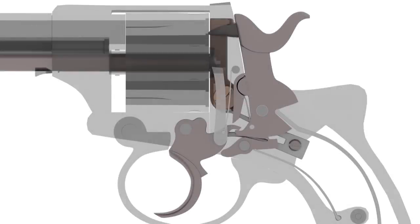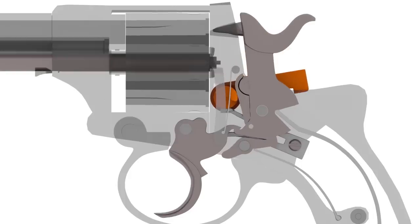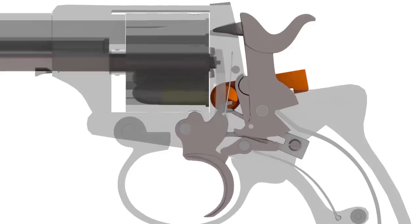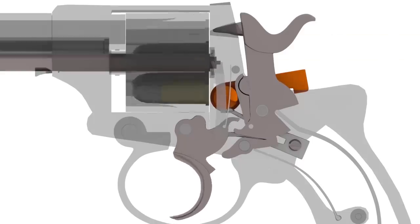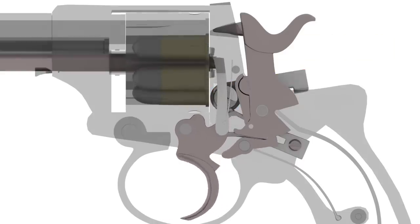These are usually just meant to keep the ammunition in place, but the Abadie patent includes a protruding half-circle lug. Opening the gate causes this lug to turn into the nose, compressing it against the hammer, which in turn is pressed rearward enough to engage its rebounded position. Now, we can load the revolver simply by placing in each round and then pulling the trigger to advance the cylinder for the next. With the nose compressed and the hammer held back, this gun cannot be fired.